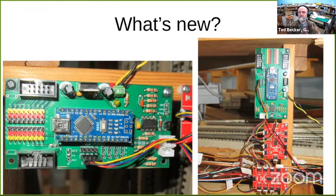One of the difficulties with them is they all have the same address, so you cannot connect multiples of them on the same I2C bus. You have to use a multiplexer like this. So that's what these are. These came from SparkFun. They just plug in, and these also require 3.3 volts. So all these wires go off to those sensors. They mount from underneath in a 3/8 inch diameter hole. Sorry, I didn't get a good photograph of those.